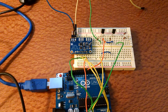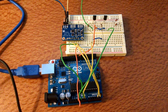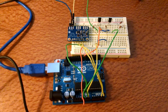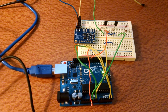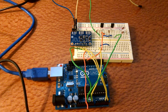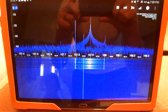I have a Adafruit SI5351 breakout board attached to an Arduino Uno and two NPN transistors that I'm using to transmit on 107.9 megahertz — the Super Mario Brothers song. On my tablet I've got SDR hooked up and you can see centered around 107.9 is my signal.